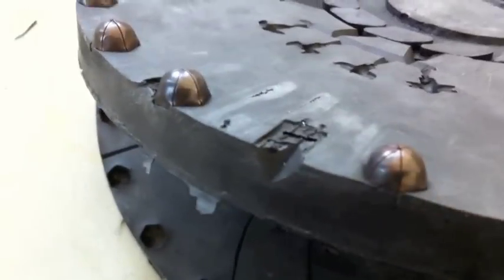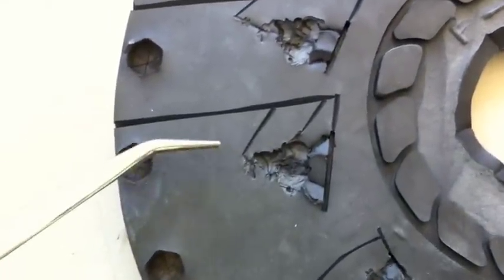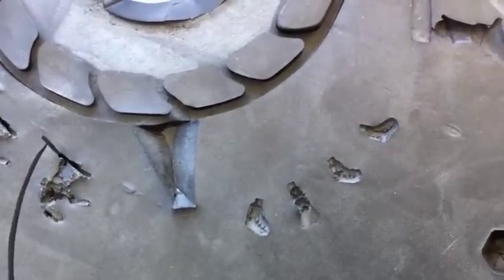This is where the shield was. I've cut a notch into the top as well so they're easy to line up. I've gone ahead and done the vents in the top here. As we were talking earlier, with the Quar bases on the cavalry, I know that's going to be hard to fill, so I've vented that out to the edge, and also the little feather in its cap and the tail of the mount. For others, I've done it from the spear and the base. The head's probably going to need it. These legs and arm bits probably won't need it — it's a straight shot. The same with the little heads — they're probably not going to need any venting at all. I probably need to vent the ends of the barrels here, and then we'll spin the mold.